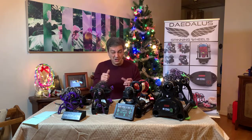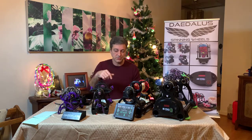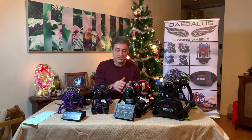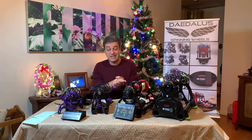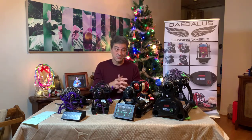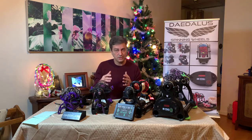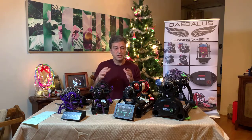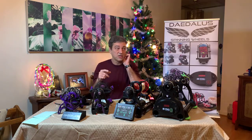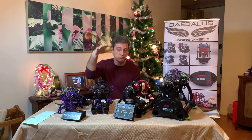When it prints out, it's actually pretty hard, pretty strong. But its weakness is the temperature resistance because of that low melting point. Not only does it have what's called a glass transition temperature, which is used in 3D printing when it actually liquefies, but the worst thing is that much lower than that temperature, PLA begins to sag when it gets warm. And when I say warm, I'm talking like temperatures in your car in the summer, in the south any time of year, and up north any time in the summer. Your car can easily get to 120, 130, 140 degrees, and you'll start to notice deformation in PLA parts. You can search YouTube for PLA summer car or something like that. You'll see tons of videos where people print PLA, put it in their car, time-lapse video, like a melting snowman.